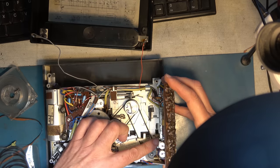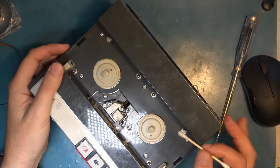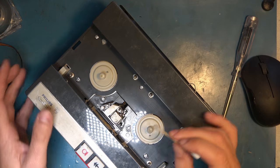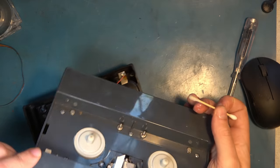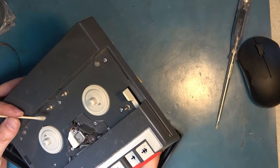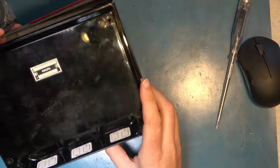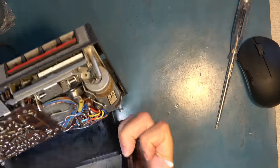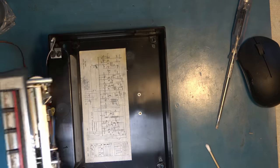Let's assemble the PCB, being careful to put this switch engagement pull thing over there. Clean the heads - though that might be a bit optimistic at this point, we're nowhere near getting any audio from this thing yet. And the capstan, which I can rotate by hand. And if we put it into play, we can clean the pinch roller too. Looking at the terminals here, trying to work out the polarity - it looks like this is positive.